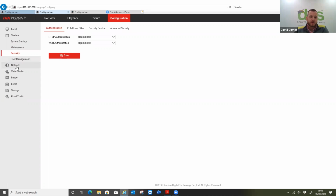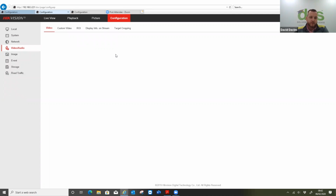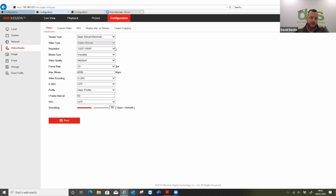The first menu you need to do something for, and for those of you that may ask the question, the 7-line product is a 2 megapixel, 25 frames a second model, whereas the IDS TCM model is available in a 2 megapixel and the 4 megapixel. So the 4 megapixel IDS TCM, which is the intelligent traffic solution model, can do up to 3 lanes of capture. We can do up to 4 lanes on any of our products, but being 2 megapixel, it's really stretching its ability. And if you're using it for barrier control, it's 1 camera per barrier, not 1 camera per 3 barriers.